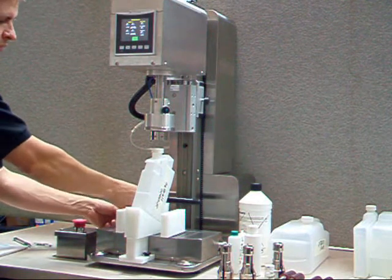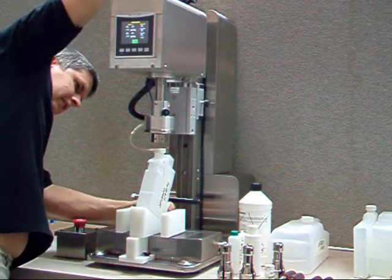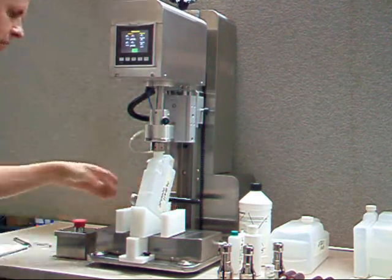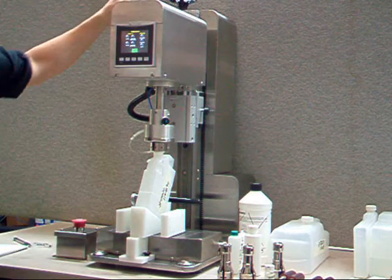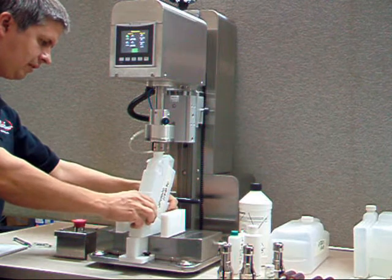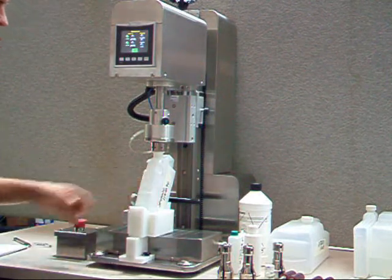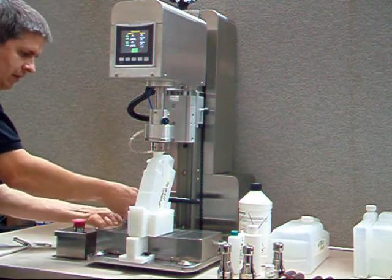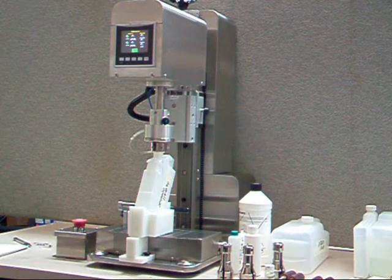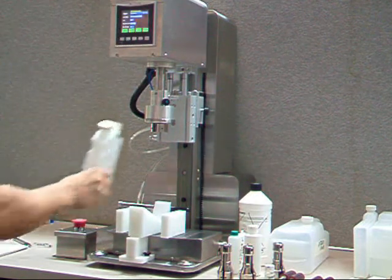Then you have to navigate back to the manual mode where you can manually actuate the head and bring it down. Once it's in the down position, I'm going to move the backstop out of the way and locate the bottle and cap until I get a clear engagement. We want to see approximately two-thirds of the cap captured inside the collet. Then I can press the chuck key on the manual screen to secure the cap inside the collet, and press the clamp key to bring the clamps in to support the container from the sides. When that's done, I can lower the backstop and secure it in position. At this point the setup is done, so I just hit the back key and go to the test screen to start testing.